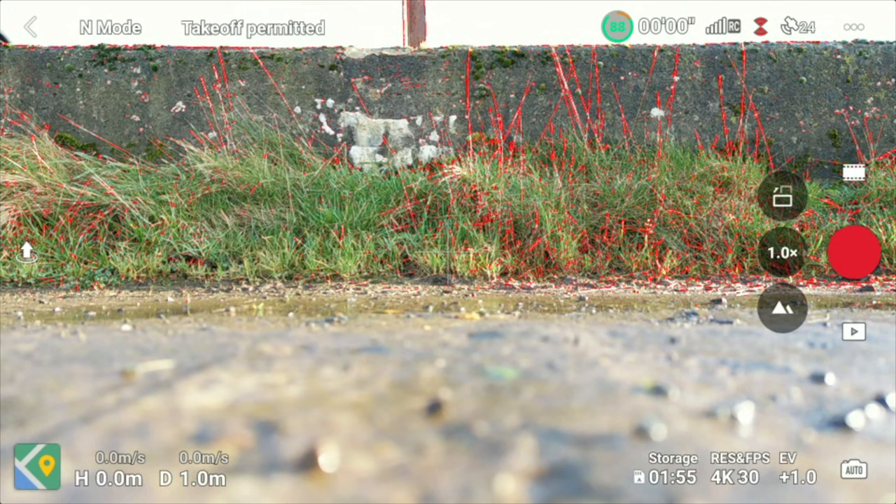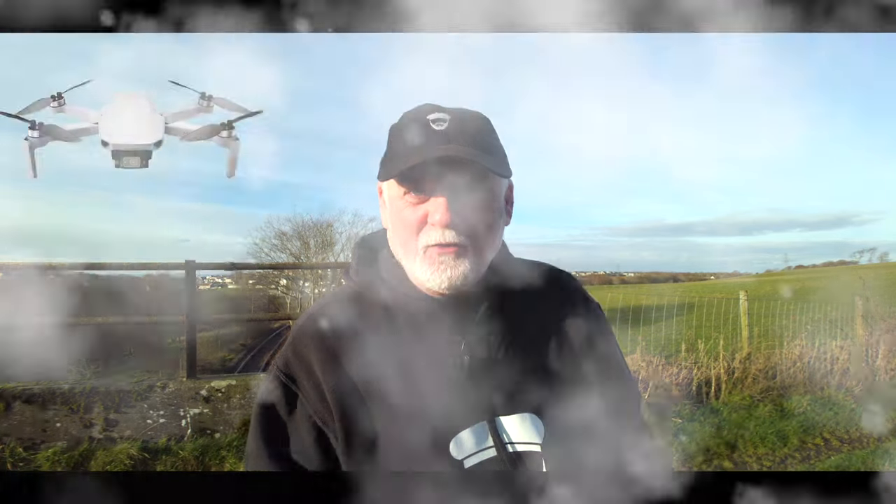You can slide it all the way down until it lands on those little mountains, and now you have what's called infinity focus. That means the camera will focus everything all at the same time, just like it does in the Mini 2. That's what you want with a drone — if you're 5 metres above the ground it will be focused on the ground, and as you raise it up it will continue to focus on the ground and anything you point the drone at.